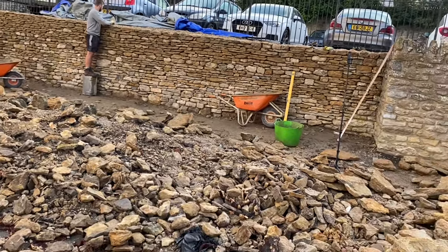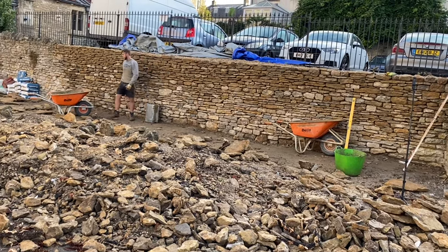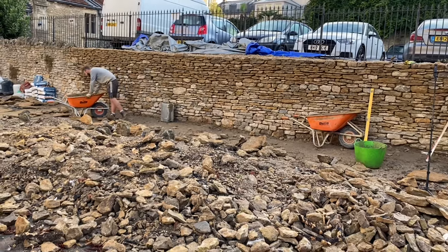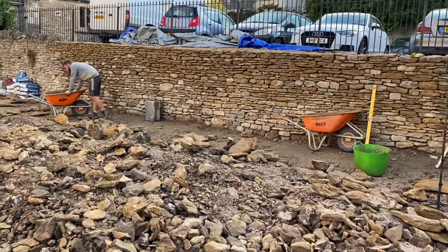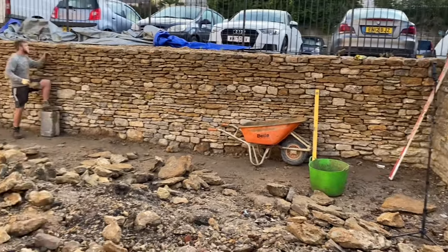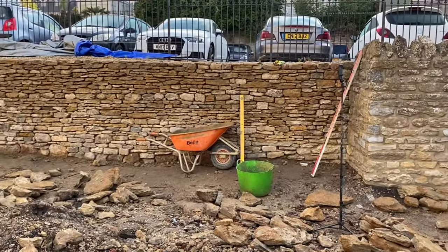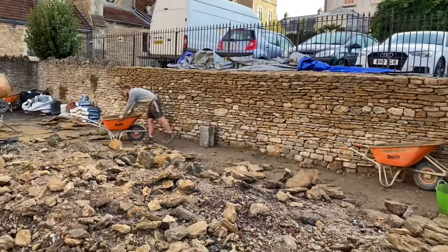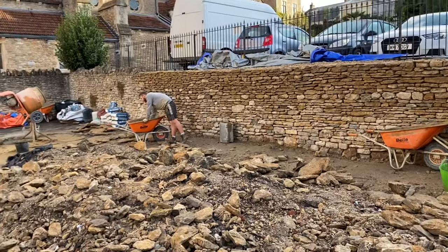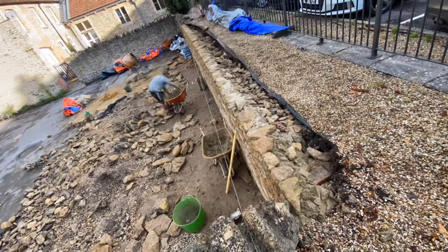So we'll put them on a slight bed of mortar, butt them up, and then rake back any mortar showing. But that's it for today. We're going to really crack it out, try to get it done in a couple of hours' light, then let it go off a little bit, then we'll flaunch all the back, maybe smooth it all up, and the job will be a good one. So anyway, without further ado, Cam, what are we doing? Crack on.